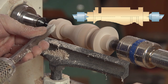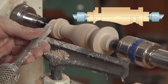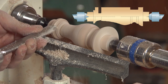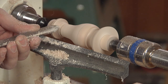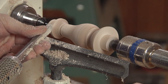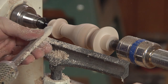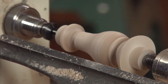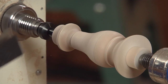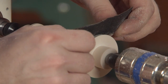Now create the cove at the top — it's just a half cove, so we only need to cut one side. Begin with the flute vertical, raise the handle, then roll the flute open, raising the handle. With the shape complete, just a little bit of final sanding. Remove the tool rest, and for the spindle since it's a small diameter, just a small piece of sandpaper held against the wood does the trick.